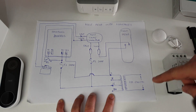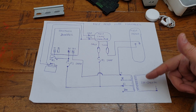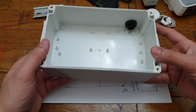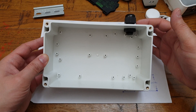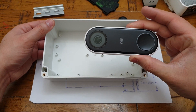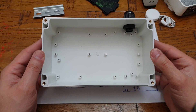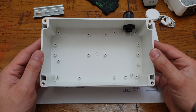Now let's go ahead with the wiring where I'll be installing all the pieces — like the transformer, fuses, Nest chime connector, and the isolation relay — right in this box. You have already noticed that I have put a 16mm gland right in here to pass the power cable to power up the transformer, as well as to pass the connections which will be going to our Nest doorbell. This part of the video will be fast-forwarded. If you have any issues installing any parts please let me know in the comment section below.